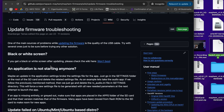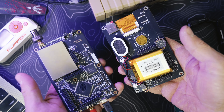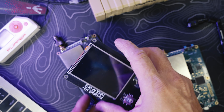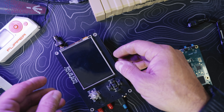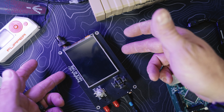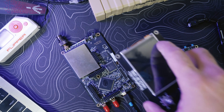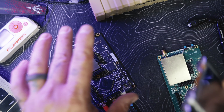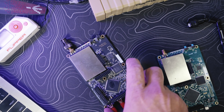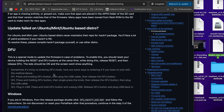If it doesn't come flashed, tear apart your system. Unscrew the four screws in the housing, take it off, and gently pull the two boards apart. You just want the HackRF One board. I found that when both boards were married together during DFU, it would not work because it was reading the PortaPack as its own unit as well. So just go straight to the raw HackRF One board.